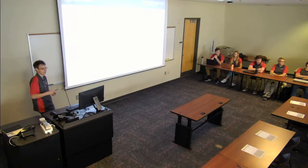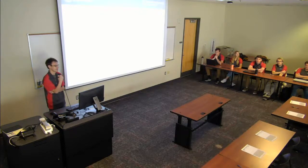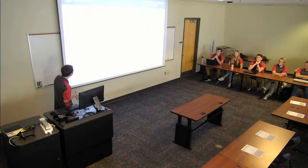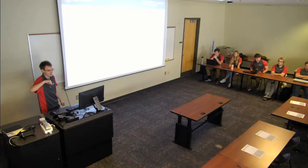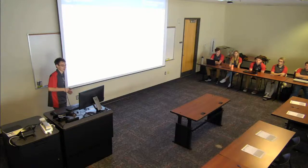I just had a quick question. Are you planning on creating a Simulink model or something to get voltage estimates, because it's just like a dynamic system? I don't know how to use Simulink, but I do know how to do Laplace transformations in MATLAB. So I got the equations of motion set up. I didn't include them, but it's your standard m x double dot plus c x dot plus 2k x equals force of the rocket minus the mechanical force of the magnet. I can get an analytical solution off of that. I just need to get measurements for the damping coefficient, or I can assume no damping because I don't really care about transient force.